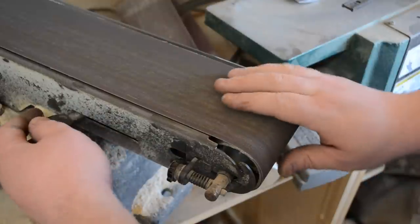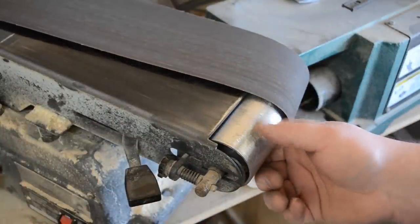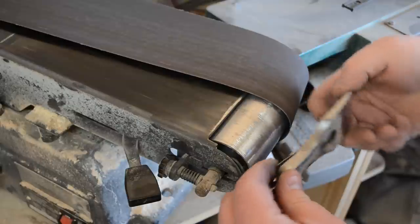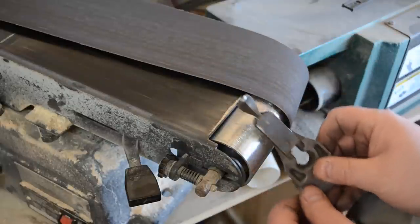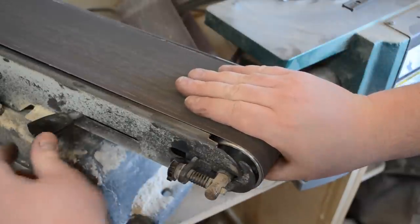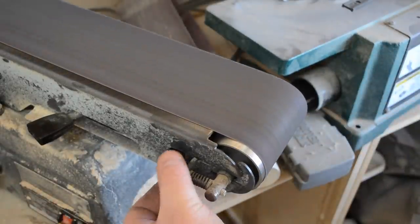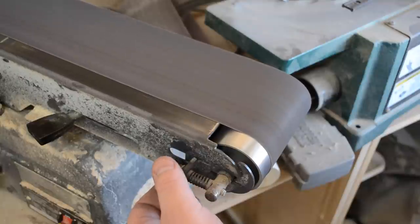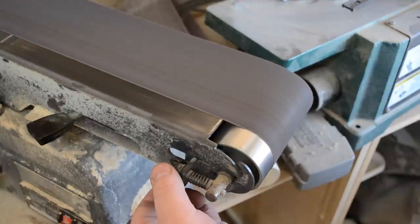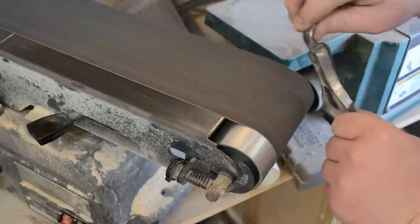As for the sides, typically when you're dealing with a belt sander with a drum on the end, it's kind of hard to get into some of these internal curves without leaving flat spots. A trick I've been using is if you run the belt off the back of the sander, it acts more like a balloon inflated drum sander and it conforms to curves without leaving any flat spots or lines.